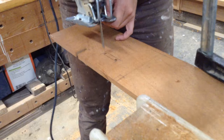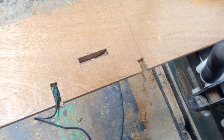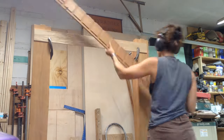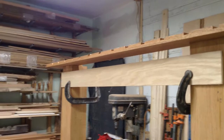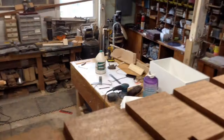I used a jigsaw to cut those out. I did the exact same thing on the other side. Then I made sure the top side fit — I had to put it the right way; it can relieve quite a bit at this point — and then I had a nice snug fit. All my marks were lining up and my pilasters were plumb, so that was a good sign. You can see it's lining up with the pilasters there and lines up at the top as well.